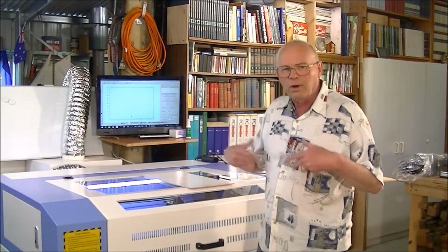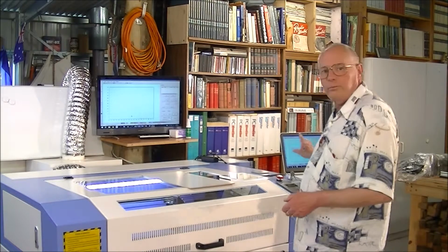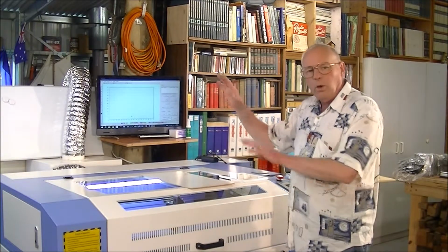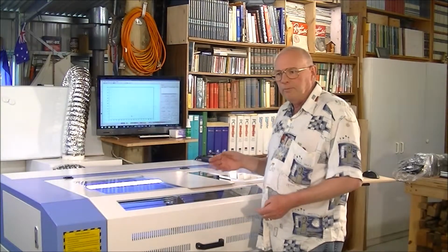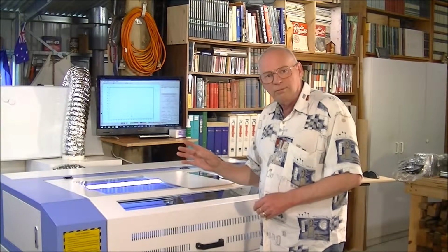Today we're going to cram quite a bit into this video. We're going to write some short programs because I want to carry out some tests. I want to find out exactly how low this laser will go. In other words, what percentage of power output of the laser is the bare minimum? What percentage does it actually start to fire? I suspect it's around about 10%, but it could be as low as 8 or 7. So we're going to find that out today.